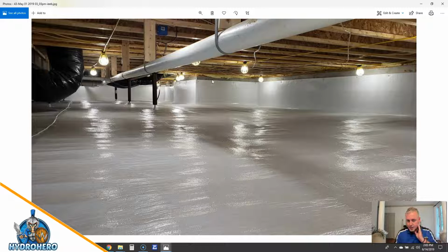And here's that inspection gap we were talking about. So we got the rigid foam board behind the vapor barrier. We have a lot of people ask, well, where is it insulated? You can't see it because we run the vapor barrier all the way to the top of the foam board, but the foam board's on the wall on this one, that 2-inch XPS foam board. And again, you can see it's all lit up nice. We left the bat insulation in the rim band there. We just fixed it, and that's a lot of overage that they had there.